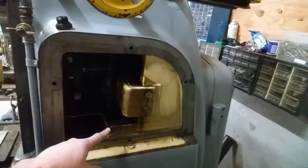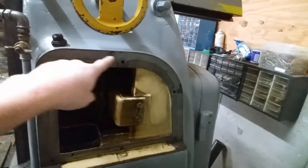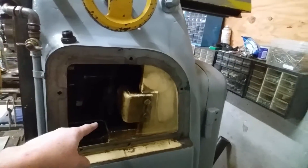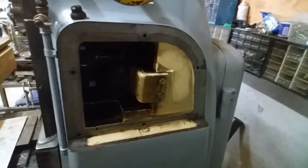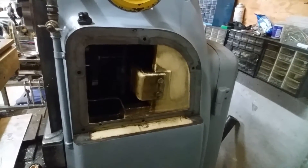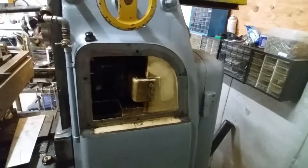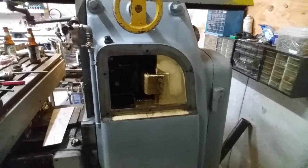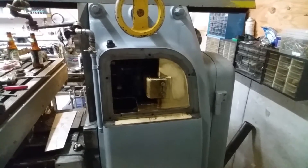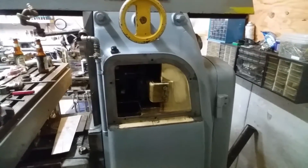These copper tubes come from the pump here and shoot onto the front and rear spindle bearings. Some of the gears in the bottom have an oil bath, and the ones on top are lubricated with this copper tube. So I'm going to get some spindle oil and run it in there. I can't find exactly what I need to use because the manual is all in Italian, and I've done some Google translation and got close on a lot of things. So now I'm good to go with just picking up the fluids that I need.